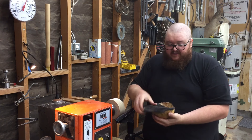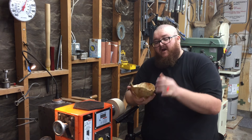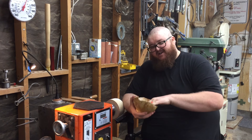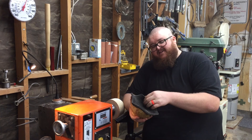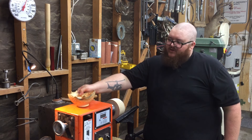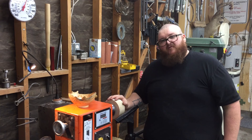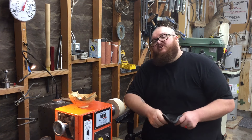Put it inside here, but also you want to make sure that your finish is cured. I know from personal experience that if you try to rush it — if your shellac's not quite cured and you get good pressure on the inside — you'll end up with kind of a little honeycomb mark. So I like to let the bowl sit for at least about 24 hours before I turn the tenons off to avoid getting any kind of marks in the finish.